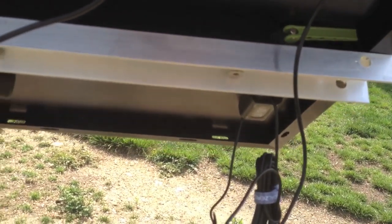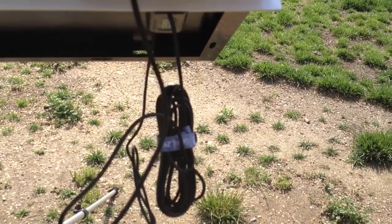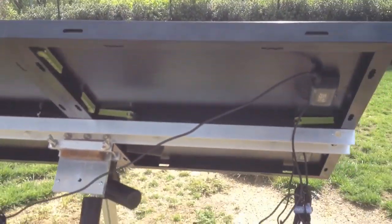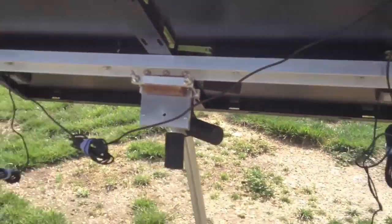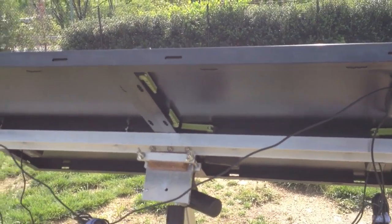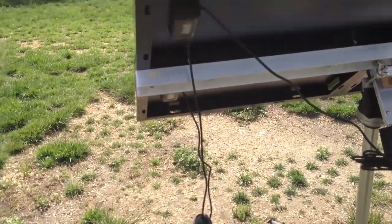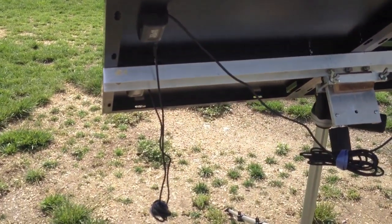What comes built into the Goal Zero Boulder 15 panels are these little boxes. Each box has a cable that comes out of it, terminating to a bundle — four or six feet of cable, probably 24 gauge, so fairly small stuff. On each one of these panels there's a chain port — these things are meant to be chained together. You just run the cable from one and plug it into the other. I have all four hooked up, so it's still giving me the 12-volt equivalent out. Because it's such small cabling, and at the end of the day if you're at the last panel you're running through almost 24 feet of cable — quite a voltage drop, I assume.